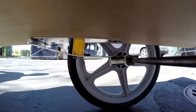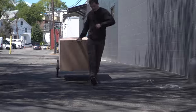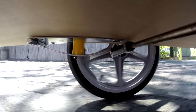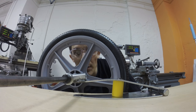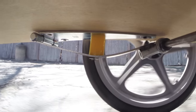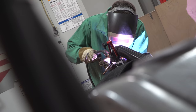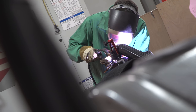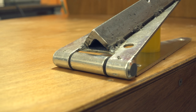Here comes a bump. Remember when I said that the hinge was going to flex but probably not flex too much? I was wrong — it flexed too much, and so it's permanently bent. All I've got to do is bend it back and then weld some more metal to it to reinforce it. This piece of angle that I welded on should keep these things nice and stiff and strong.